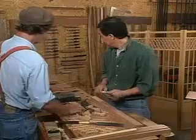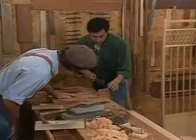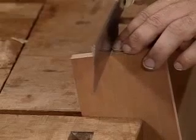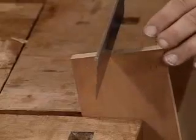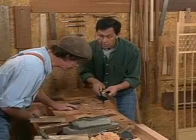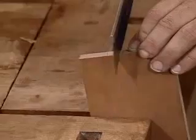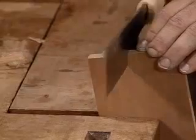Can we do a little bit of that? Sure, you can see how remarkably fine they cut, very straight. It sort of takes all the magic out of dovetailing if you've got a nice saw. It's just too easy. But again, ripped teeth because we're going down the grain. Right, and they hook a little more than Western. Yes, and I apply virtually no pressure. The saw cuts rapidly and straight and beautifully. Well, of course, because the hook tends to feed itself. It's a hungrier saw than what we're used to.